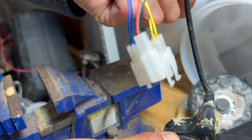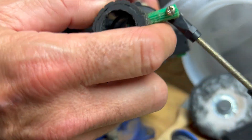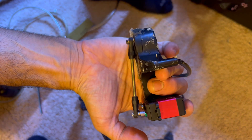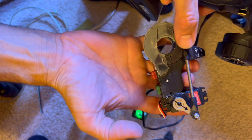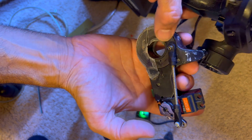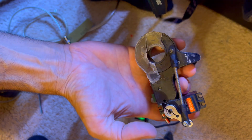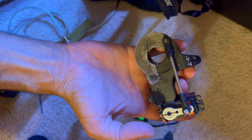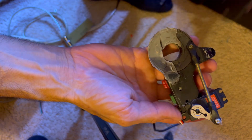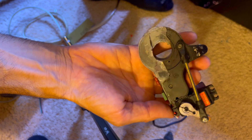There are three connectors. I'm going to chop it off right here and make it cleaner. I sawed the handle off — there was a handle here and I just sawed it off. Put a screw in it. Behind here is a little magnet and a little sensor that picks up the signal from the magnet — it determines where this rod is at. I'm going to wrap a zip tie around here and glue it on. I don't want this thing to fall apart in the ocean and be stuck with no throttle.